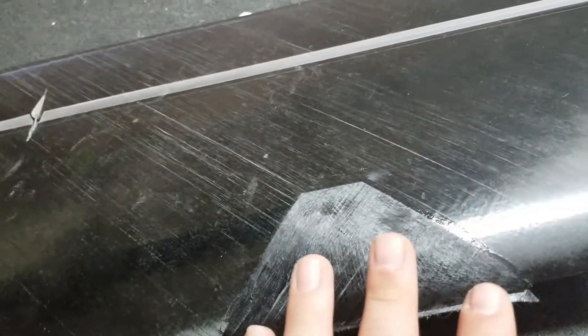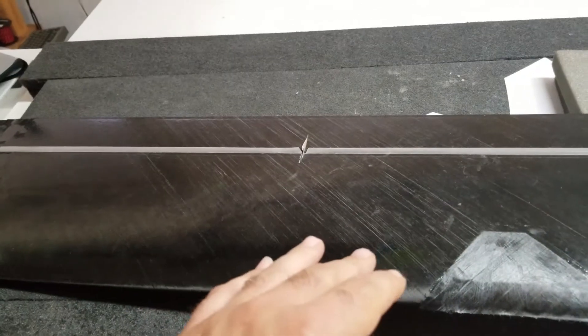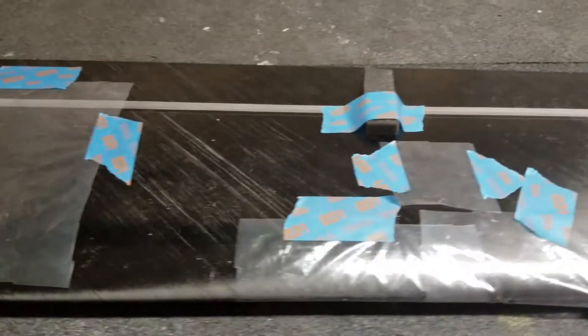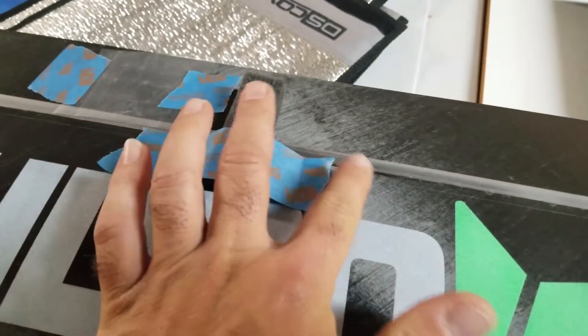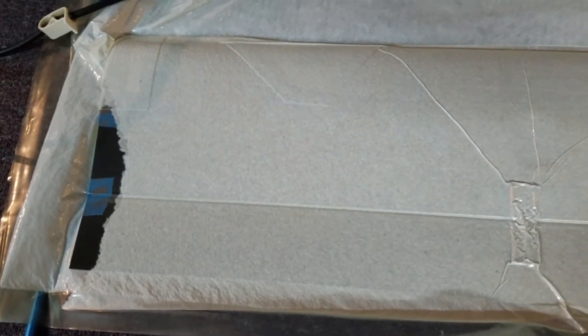Now I'm going to put a paper towel over this to soak up as much excess epoxy as I can. Then I'll prep the little pieces of mylar — put some wax on them — and prep the vacuum bag. The mylar is now taped in place, I've soaked up excess resin, put pieces of plain plastic over the areas where I injected epoxy so the bag won't stick, and covered hard points with foam to avoid puncturing the bag.